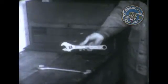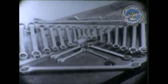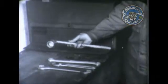Adjustable wrenches, which are less safe than the solid type. Box wrenches, because of their design, safer than open-end wrenches. Spanner wrenches, which are used on special fastening devices. Inverted socket type wrenches, which often are called Allen wrenches or keys. And socket wrenches, which are the safest and can be used on almost all fittings.